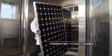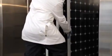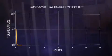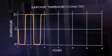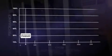This is the temperature cycling chamber, designed to simulate real-world temperature changes for over two and a half decades. Inside, solar panels are subjected to rapidly changing temperatures. First, the temperature falls to negative 40 degrees Fahrenheit. Then it rises to 185 degrees Fahrenheit, all in under five hours. And then it cycles again, and again, and again.